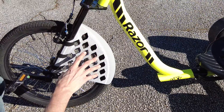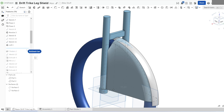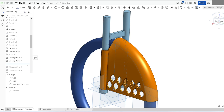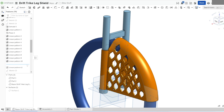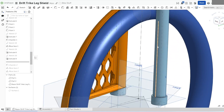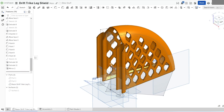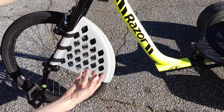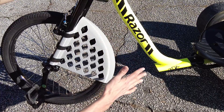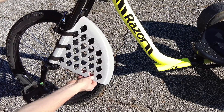So this was my first attempt at 3D printing this fender. Watch as I designed it in OnShape, my favorite 3D CAD software. Making this fender was a first in many aspects for me — it's the biggest 3D print I've ever made in one single part in one shot. It's also the first time I've used NinjaFlex Cheetah TPU. I usually use regular NinjaFlex which is about 80-85A durometer, which is softer. The NinjaFlex Cheetah is a 95A TPU — more rigid, feeds easier, prints easier — but it's still not rigid enough, and I wanted something flexible so it would survive impact and not break.